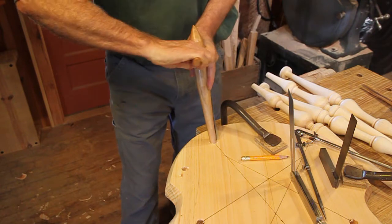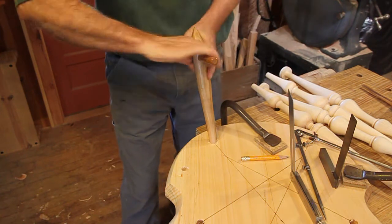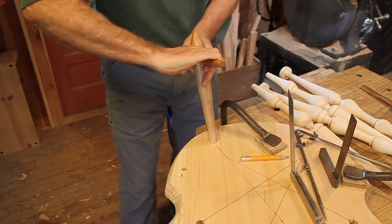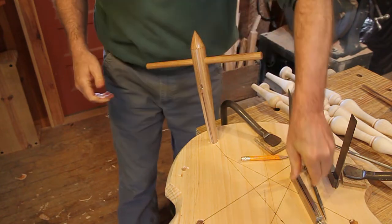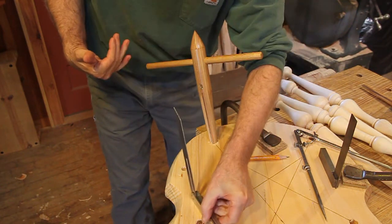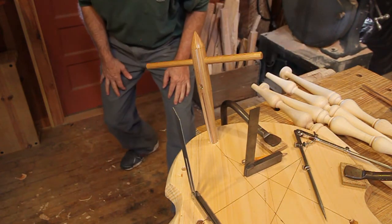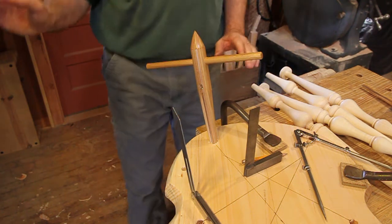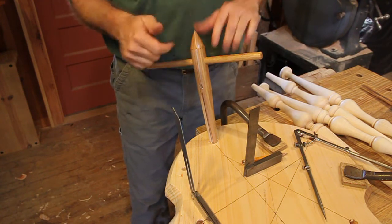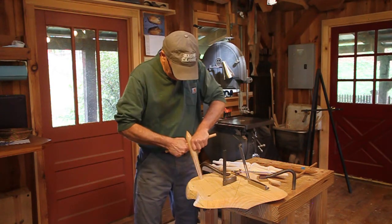And you keep the reamer seated. You don't let it get up here and waller around. You keep it seated right like that, and then you'll have to pull it out and clean it. But before I pull it out and clean it, I'll check that angle. I need to come back, and I'll check the sighting angle, and I need to go right. So right and back is what I'm going to go after I clean the reamer out. So I've got the reamer cleaned out, and I'm going to go right and back.